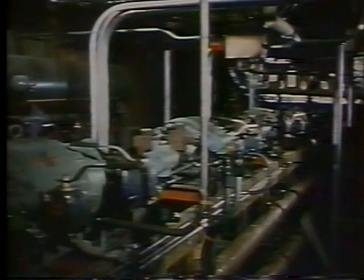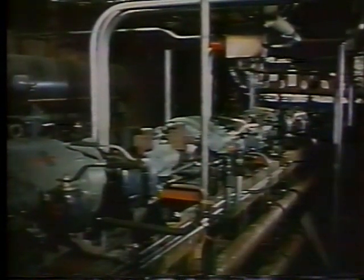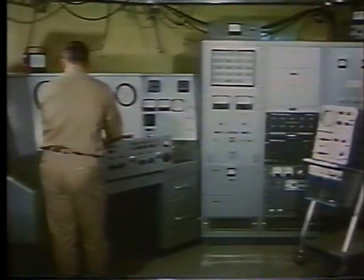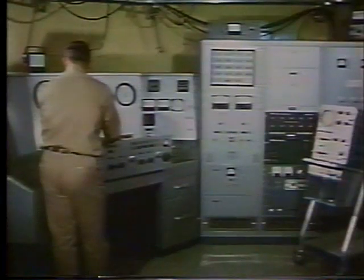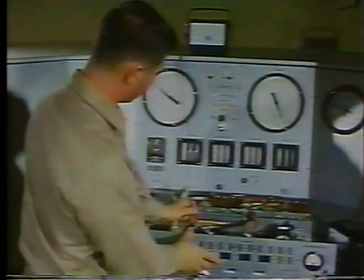The flow to each hydropad recess is constant and is maintained by 32 constant volume, constant speed pumps, delivering oil at pressures up to 4,500 pounds per square inch as called for by each pad recess. These pumps are located on the second floor of the foundation. The operating console and workspace are located on the main floor. The telescope will be controlled electrically from this point.